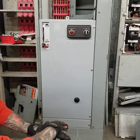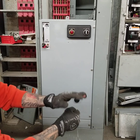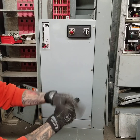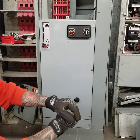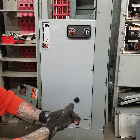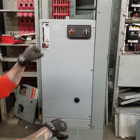In this vintage, it was available for the 150-amp FA frame breaker types and 100-amp fusible switch style — those go on with one set of fingers each and go on and off pretty easy. On the larger sizes, the KA type breakers and 200-amp fusible switches, those go to a double finger setup, which can make it a little more challenging getting on and off the bus.